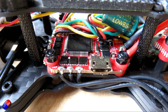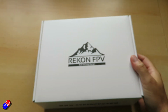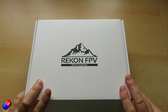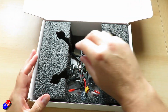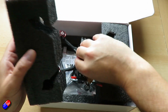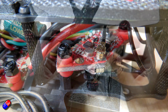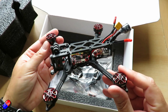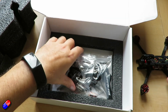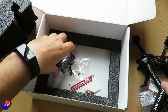Inside is a Zeus 25 all-in-one 3 to 6S flight controller. Makes the build incredibly neat. Standard size, and it is an F7 based flight controller, which means that this thing can run lots and lots of the Betaflight stuff turned on and not even break a sweat. At the back, they've gone for a Zeus Nano 350mW VTX. That'll support PIT, 25, 200 and 350mW. I really like these Zeus Nanos. I've got them in lots of different things, including some sub 250 gram planes, and they just work.